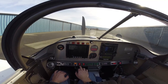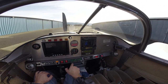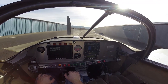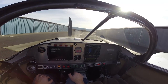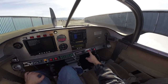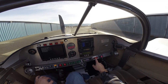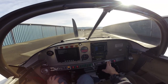Everything over here is just pretty standard avionics for the radios and the Grand Rapids EFIS system. We have the prop controller, which is the Quinty prop — it's fully digital. You just set the RPM you want and it will change the propeller accordingly. There's also a mode where you can lock the propeller in a certain pitch and make it behave like a fixed-pitch propeller. Over here I have one more system installed, which is purely a wire running from the second battery through a multipole switch to the engine computer, fuel pumps, and coils — a fully independent backup system the engine will run on without anything else operating.